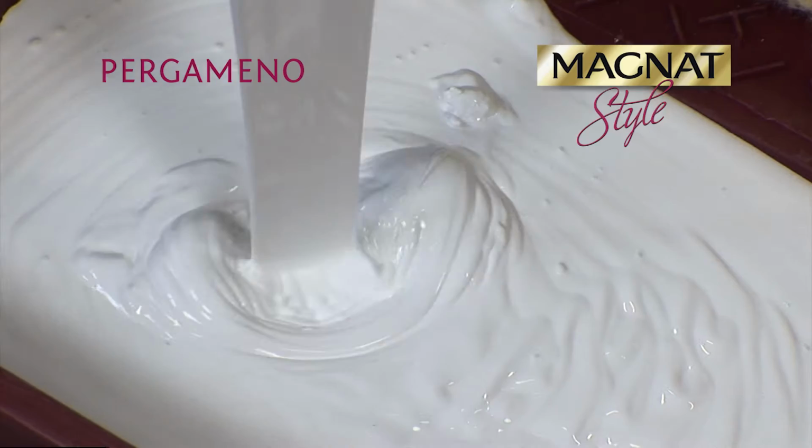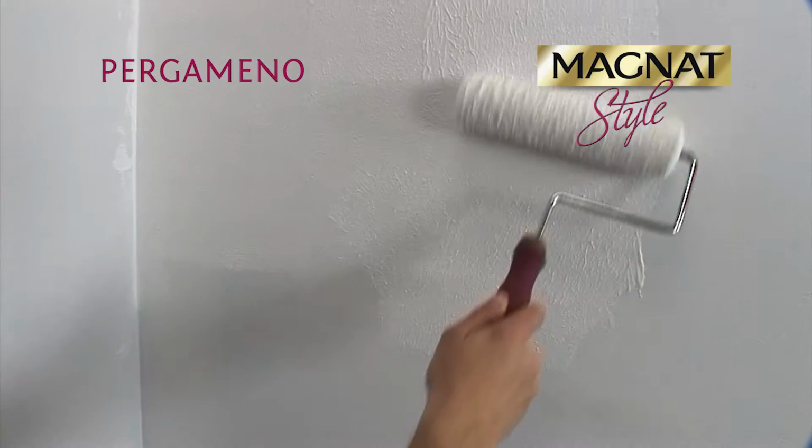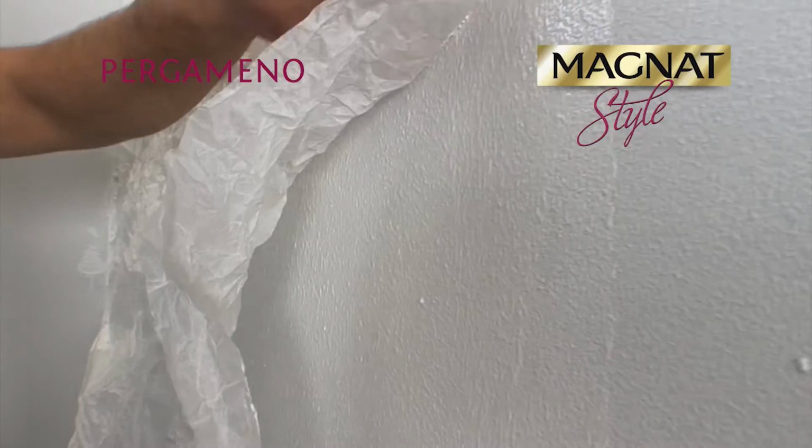Apply a thick layer of the distemper with a roller on a patch slightly larger than one paper sheet. Stick the pergameno paper sheet immediately onto the distemper coating, stretch the sheet, gently forming the desired texture.